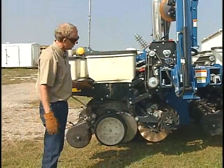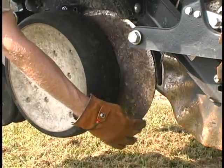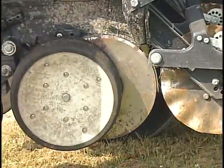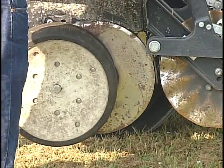When I say evenly matched, right at the soil entry point, there's some blade contact — or there should be some blade contact there. If you think about this being a clock dial, down here at about that four o'clock position, we need to have probably about an inch and a quarter, maybe an inch and a half of blade contact.